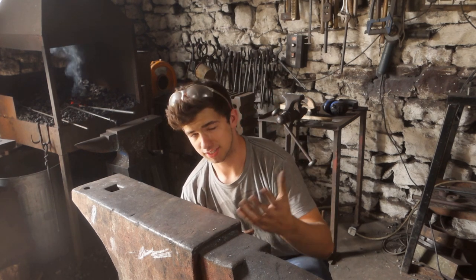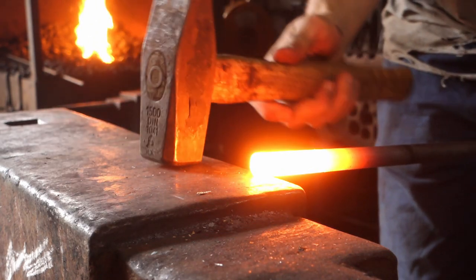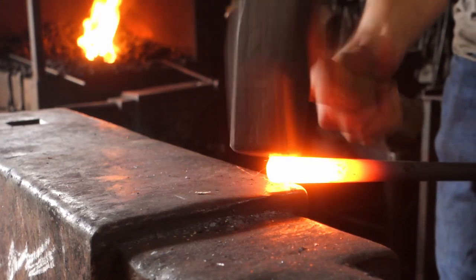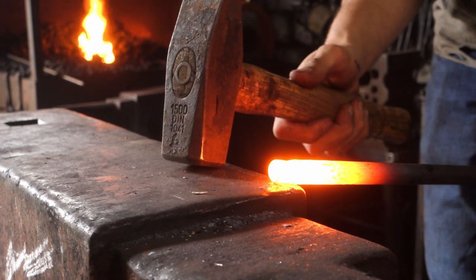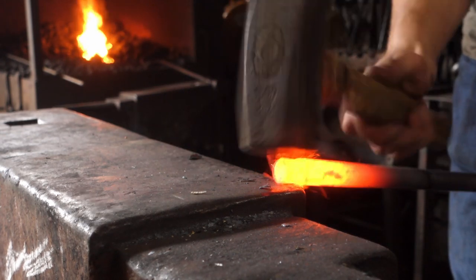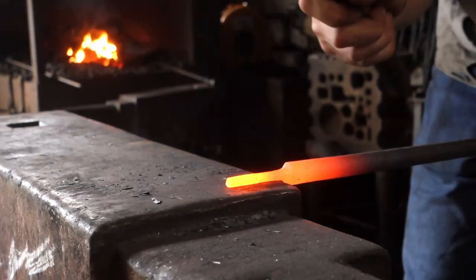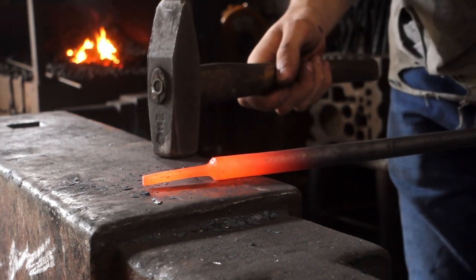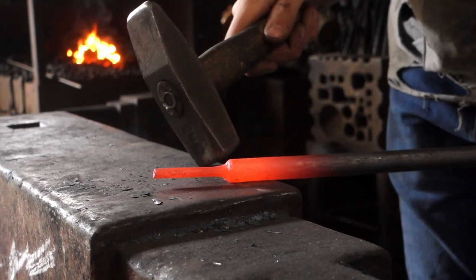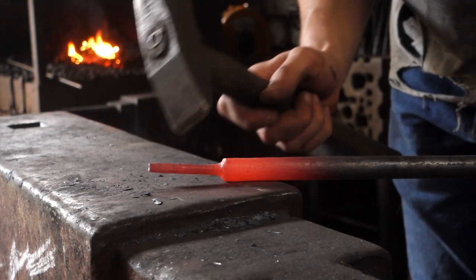Anyway, I've got the piece in the fire, it's already hot as you've seen, so we can take it out now and begin to forge on the end of the bar. I'm rotating constantly so I get a nice round transition down to the bar. Unfortunately that didn't work quite as well as I thought it was going to. I'm going to have to come in with the hammer and carefully clean up around that edge so we get a nice round transition going down into this stem of material.